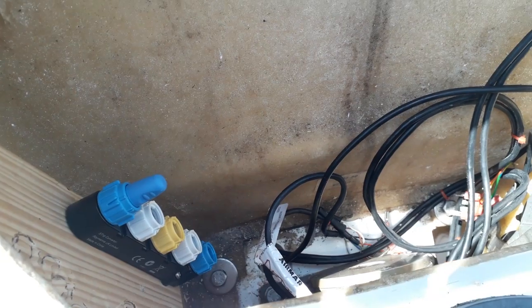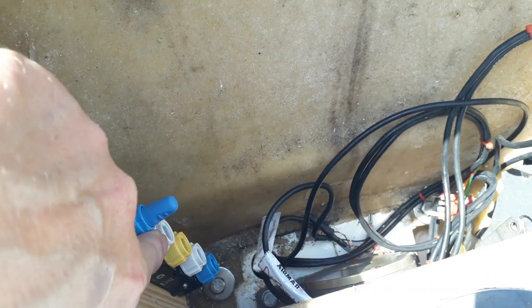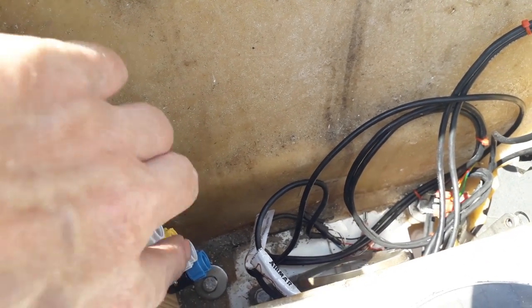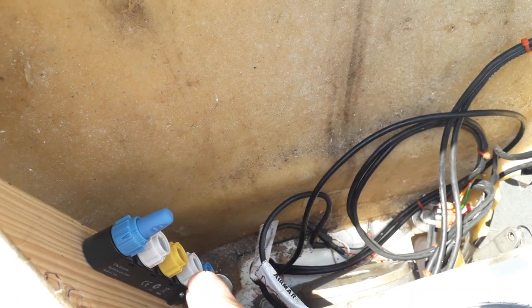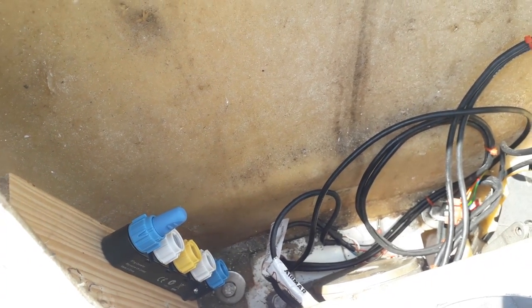While Skeiner was working below deck, I put a hub into the binnacle. So down here you can see where we're installing the Raymarine hub. This is the terminating block. The P70 will go in here. The classic instruments, ST1, SeaTalk 1, will go in there. And the chart plotter will go in there. And then that will go down to the hub down below decks.